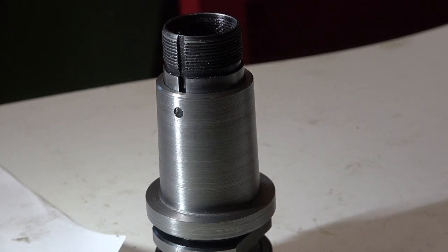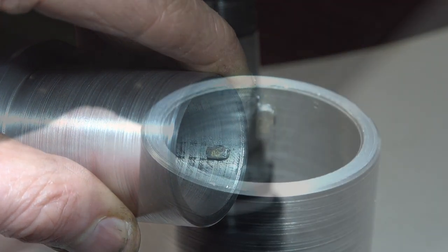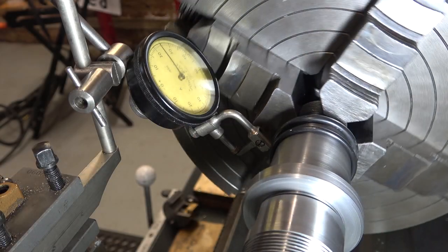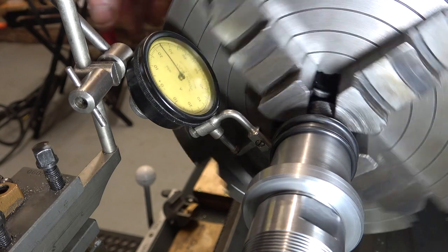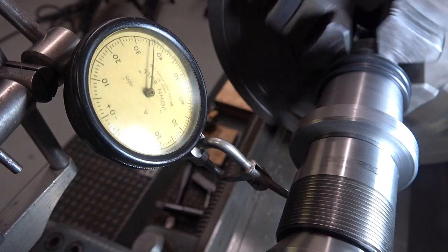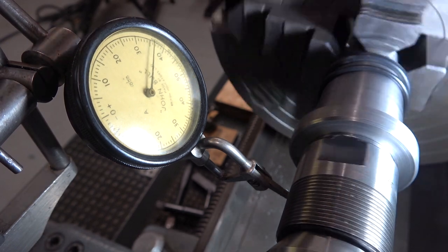The peg is in the bush. It's quite difficult to work at that scale. This is clocking the front next to the chuck — it jumps as it goes over the keyway, but otherwise that's spot on. This is out by about a thou, but I don't know how I can get it any better than that.